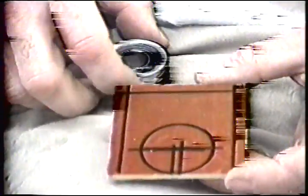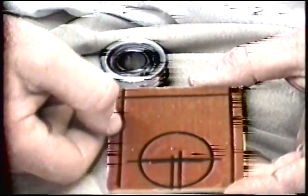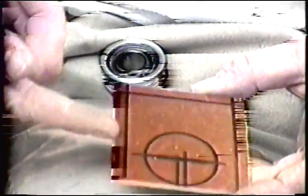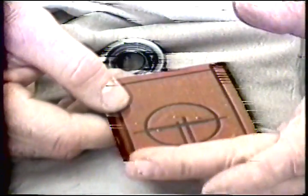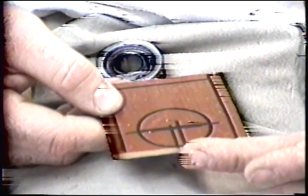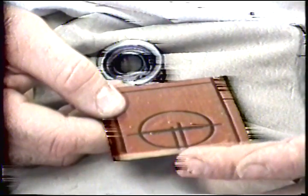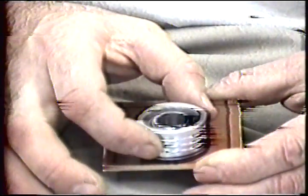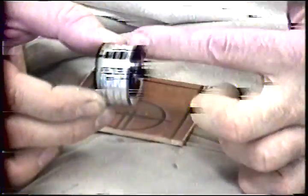Now the next element of this operation is a 3-inch by 3-inch, 1/8 inch thick phenolic plate. Now you notice I've back set it about 5/16 of an inch. I'm going to bevel that to nothing on 3 faces. This corner, this corner, this corner. This will be the surface that rides along the upper edge of the inboard end of the wing. And the unit ball will ride right here. This will be grit blasted. This will be sanded on the back side.